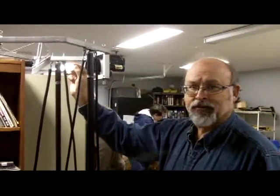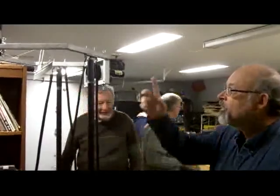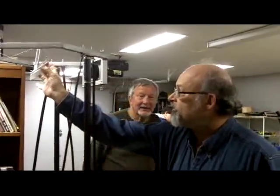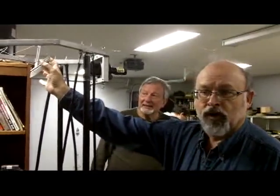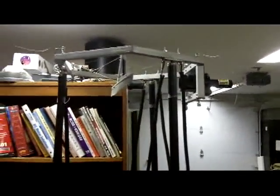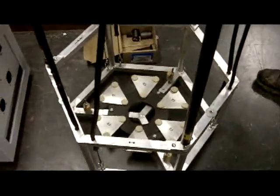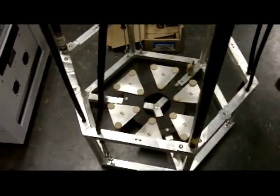And these are high E guitar strings. It's stainless steel. I think they're 1/10 of a millimeter. So the entire secondary structure here weighs just 11 ounces, including the glass. About 10 3/4 ounces. Well, 10 3/4 ounces now, yes. What I did here was, again, going for lightweight.